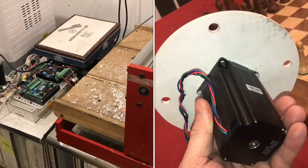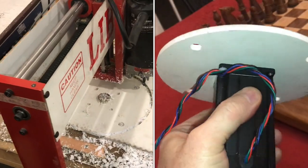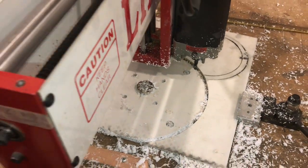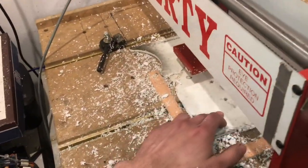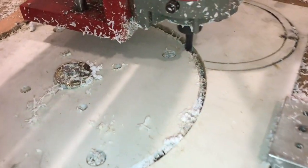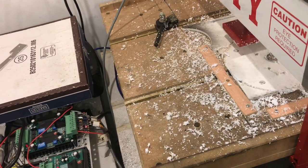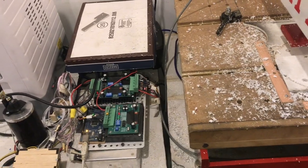Tonight I'm making a project for work. It is a motor mounting plate to adapt from a NEMA 23 stepper motor to a 56C plate. 56C is the name of the standard size of a motor, so I'm hooking up to a gearbox that's meant to work with a 56C motor, but I'm using a NEMA 23 instead.